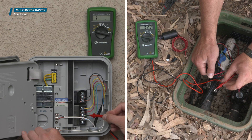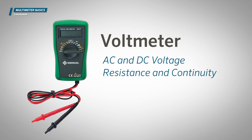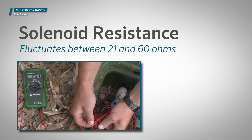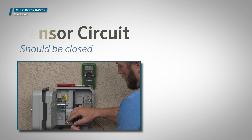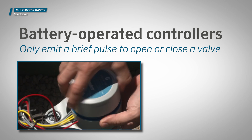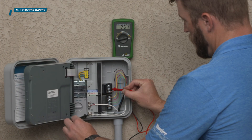As you can see, a voltmeter comes in very handy when you're troubleshooting your irrigation system. It's important that your voltmeter can read for AC voltage and DC voltage, and that it can test for resistance and continuity. There must be 24 volts AC coming out of the controller and going out to the valves. The resistance of a good solenoid fluctuates between 21 and 60 ohms. Hunter sensors are normally closed, so the normal state of a sensor circuit should be closed — if you detect an open line when testing for continuity, you either have a wet sensor or a break in the sensor circuit. Finally, remember that battery-operated controllers only emit a brief pulse to open or close a valve. Refer to your voltmeter's owner manual for specific instructions on how to get the best out of it.